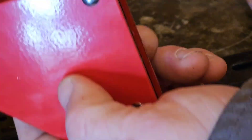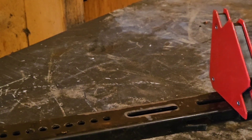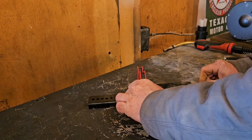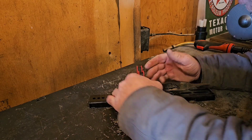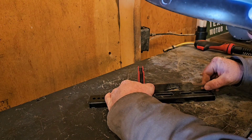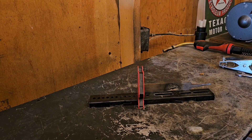We're going to use this magnet to set up a 90-degree joint. It's not a very tall piece of metal, but put the magnet on here, leave a little gap, and get it lined up on the back there pretty good. The reason you want to grind the edge down is you want somewhere for the weld to fill and anchor well — if you don't bevel it you're just welding two little lips together. Open them up a little, fill the gap, and it makes a stronger weld.